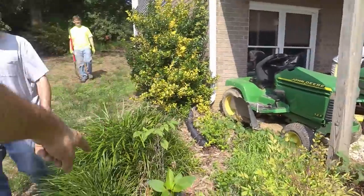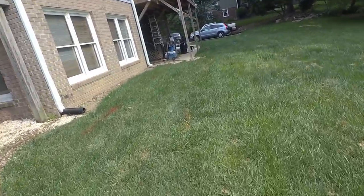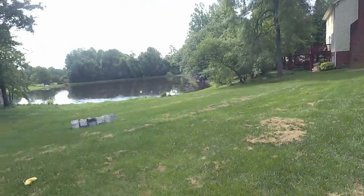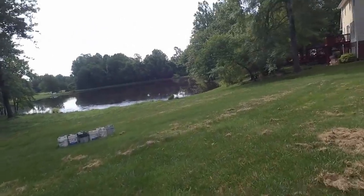We're gonna catch this one into our 6-inch. And then we'll loop all these into 4 into the 6-inch. Yep, loop these 2 into 4 and then into 6 down there somewhere. And then our outfall is just going to be in the grass somewhere.